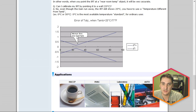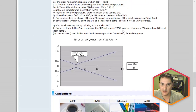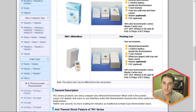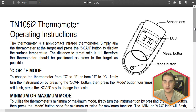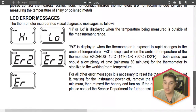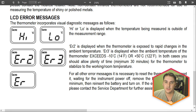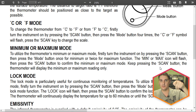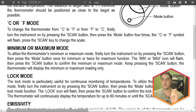So you can see here — it's the temperature of object versus temperature of ambient. Based on that, your error can go out to 1.5 degrees, and obviously the further out you go on this scale, the further your tolerance is going to expand. I'll leave links to this page and the Hobby King page in the description. I also found the instruction manual on the Zytemp website. Basically you can change your emissivity, which is awesome. You can also set it to min or max mode, so it'll read out the maximum or minimum temperature from the samples you've taken, which is really handy. I use that a lot.